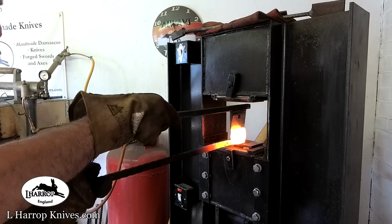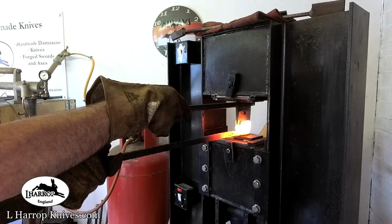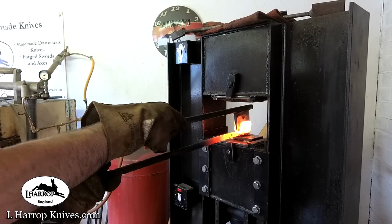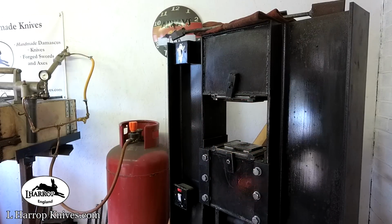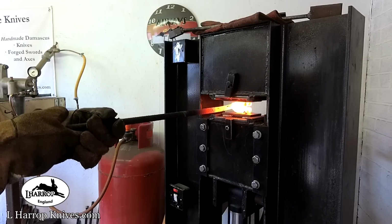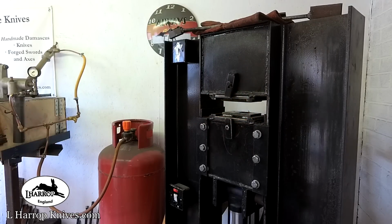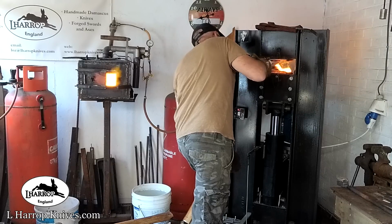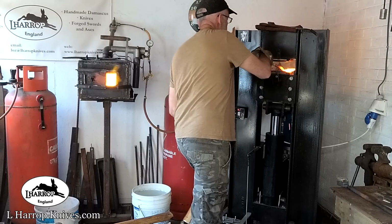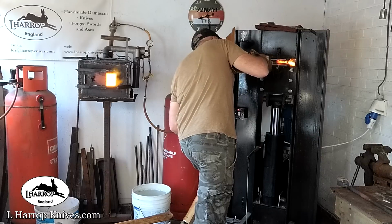And this is me doing the cut for the feather now. It was a bit of a disaster, although it cut fantastic, I could not get the cutter out of the billet. I hammered on it for ages, and I think what happened was forging scale just built up in that joint and it didn't weld. It would not weld. I tried 3 or 4 times to push this together, it wouldn't work.